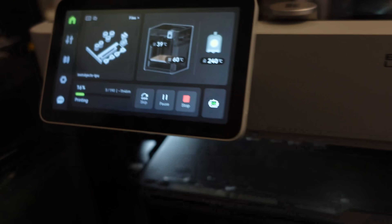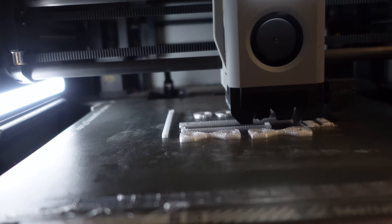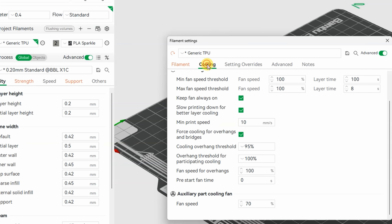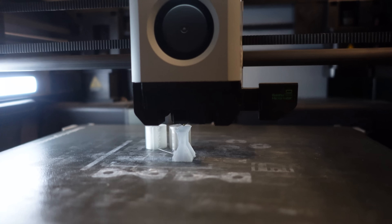As you can see, I am printing at 240 degrees Celsius with doors opened and the auxiliary fan off — and it looks much healthier now. I also turned off the filament dryer just to prevent repeating the heat creep. But it clogged again. And finally, the settings which work for me: generic TPU as the base, modified temperature and flow rate, auxiliary fan completely disabled, and part cooling fan reduced to between 50 and 80%. I decided to print in smaller groups, and also removed the top cover. This method finally works.